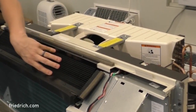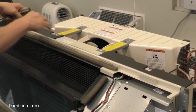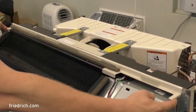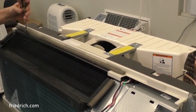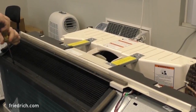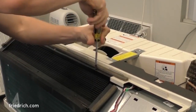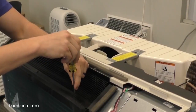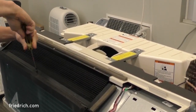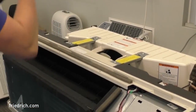We're going to talk about how to take the top plate and the blower guard off of the SG-Series P-Tex. You're going to have six screws that hold the blower guard in place — four across the top and one on either end on the right and left hand side. Make sure these guards go back in. The last thing you want is somebody dropping something down into this blower wheel — it moves very fast and is metal. It will hurt. Once those six screws are removed, that guard lifts up and out. You can set that aside.